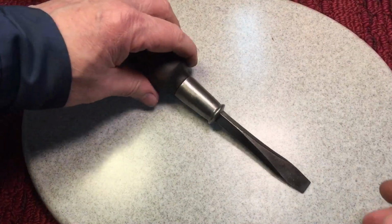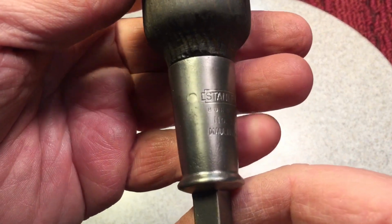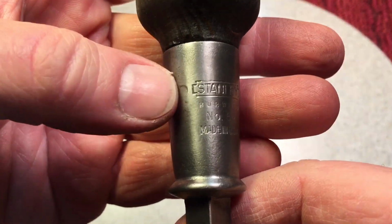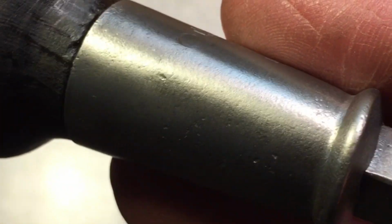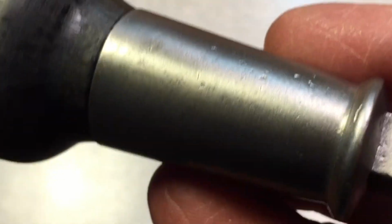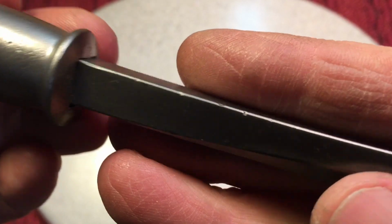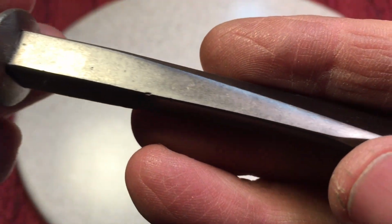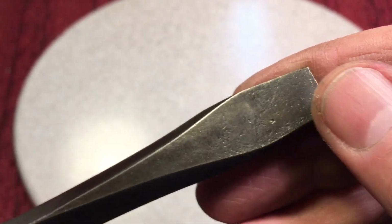Okay, here we are at our post wire brush evaluation. You can see here, no surprises. The wire brush always leaves that little bit of that finish. How can we describe it? Almost like a dimpled, an orange peel finish. I'm not crazy about that finish. Same thing with the steel here, we still have the pits. The wire brush will not get rid of the pits, especially on the blade and stuff. You see there? I don't like it.